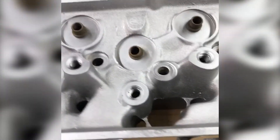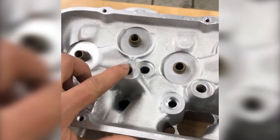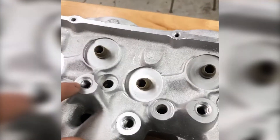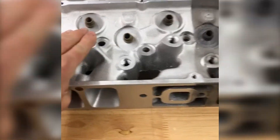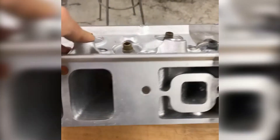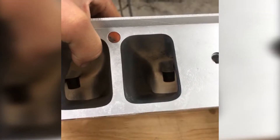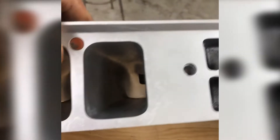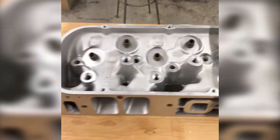And I mean, what a huge difference. One of the greatest things that I like about the vapor honing system is you can clean in some deep places, some threaded holes without damaging the threads. You can clean everything very well, but there are sometimes some challenges when you come into some of these deep areas like some of these ports here — specifically how deep these are in some of the bins. But overall, 95% of the part is meticulously cleaned.